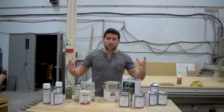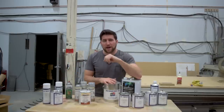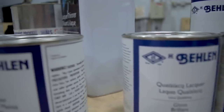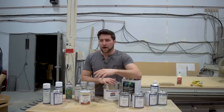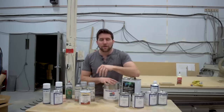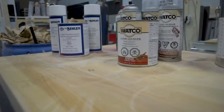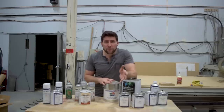As you can probably tell, I've used a few lacquers. There are a bunch of different types, there are a bunch of different brands — nitrocellulose being probably the most common for, say, guitars and a lot of furniture, although there's been a shift lately to acrylics, and those are more common in cans now. But the thing that seems to confuse people is they think you spray something and then you wait for it to cure. But lacquer doesn't do that. It only dries.